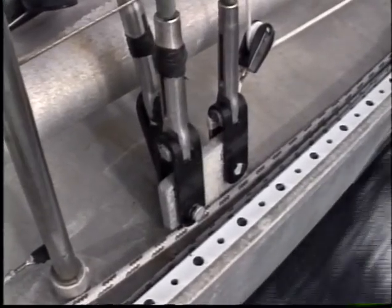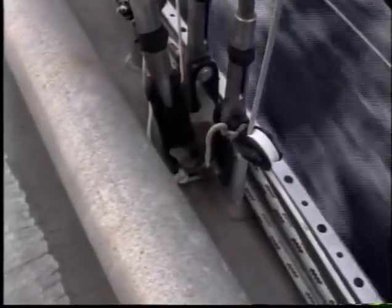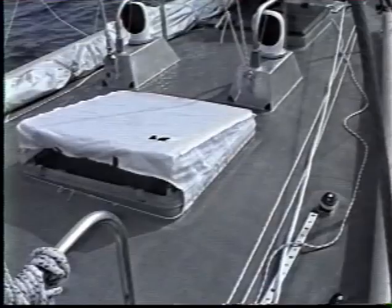The chain plates take the highest load of any part of the boat. They're welded to the hull and deck too. Hatch coamings are welded too and have round bar lips for easy attachment of storm covers.